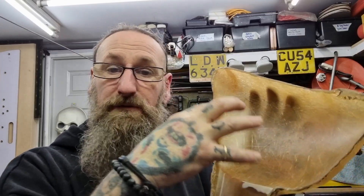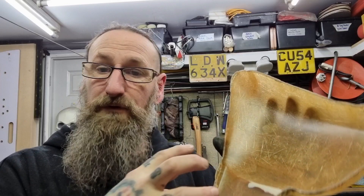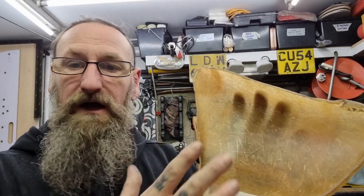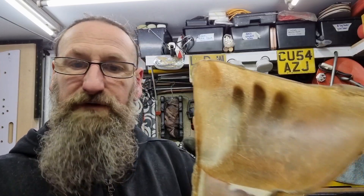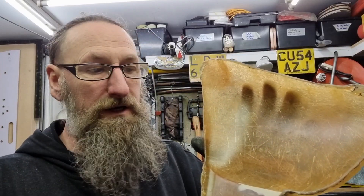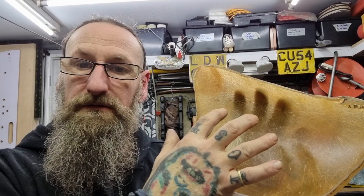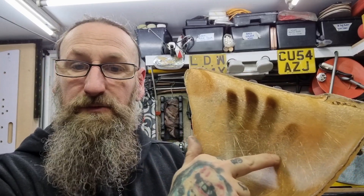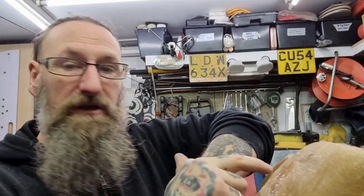We're ready now to take our positive impression from this. Exactly the same again — I'm going to paint it all first with some resin and hardener to act as kind of like a ghetto gel coat, leave that for probably 45 minutes or so to tack over, then I'll go in there with two layers of fiberglass.